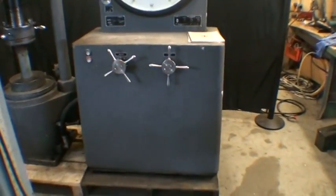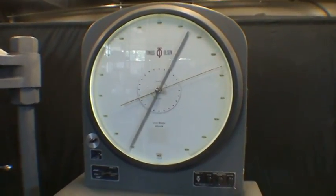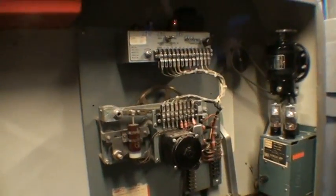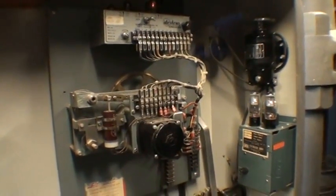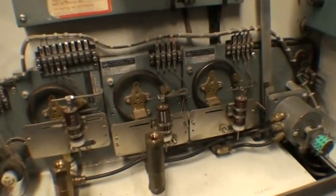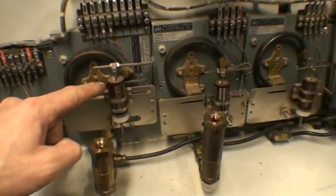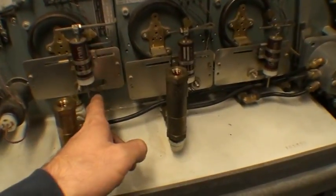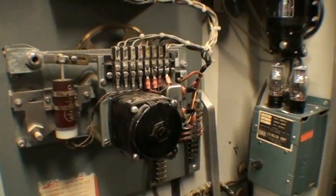Here's the hydraulic supply and gauge readout. It still has the original mechanical gauge assembly. A lot of newer retrofits just remove all this stuff, although it is a very neat system. It's got three different ranges of the Bourdon tubes. The Bourdon tube operates the linear positioner, which then converts the signal to an electric signal, which operates this little stepper motor here, which turns the gauge.